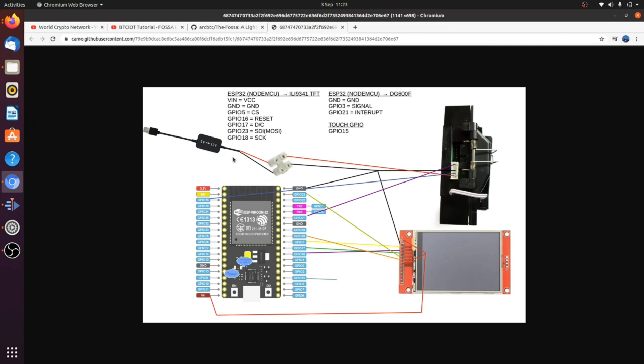You will have to cut off the end of the wire for the 12V side and sheathe it so it will fit inside the screw terminal. The ground is also shared with the ESP32, as we have a signal pin coming from the coin mechanism going to GPIO 36 — that's going to send the numbers from the coin mech depending on what coins you put in. We're also grounding our TFT screen. The TFT screen has two 5V power inputs which use the VIN on the ESP32. There are also a bunch of SPI wires coming off the TFT board to specific GPIO pins — zoom in, take your time, wire it all up and you should be fine.